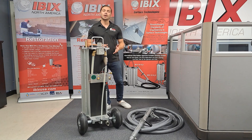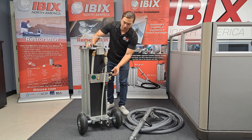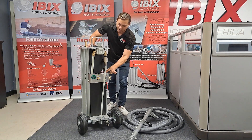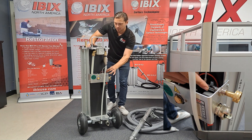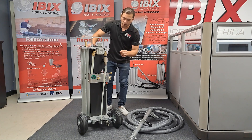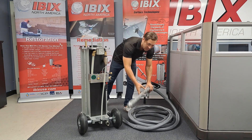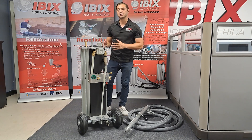The Hi-Pro 60 is a wet and dry function system. On the right of the back plate we have our female water connection, so if you have a regular garden hose you can hook it up to the side of the unit. From there you can use the water feature at zero mist, or turn it to the right for a medium mist, and all the way right for a full mist — the main function being dust suppression. The water line runs from the back of the unit parallel to the blast hose and meets at the tip at your water shroud, so the water does not mix with the material inside the pot. The material inside the pot will stay dry at all times.